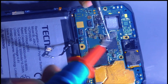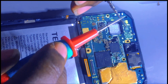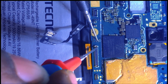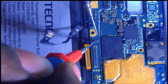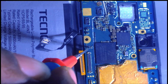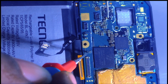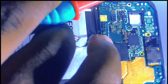Let me check the line I showed you. You hear a sound from our multimeter - yes! This means the first line is good. We continue from here to here, to this capacitor - okay, this resistor - okay. Until here, the positive line is confirmed okay.